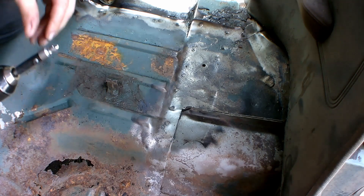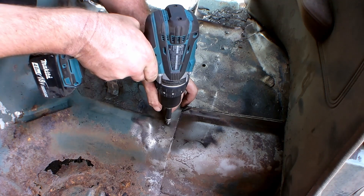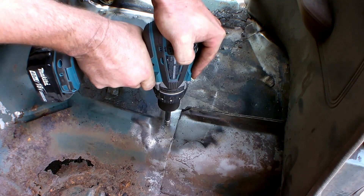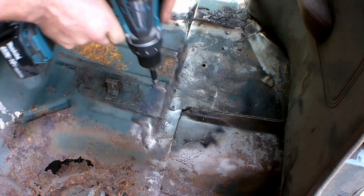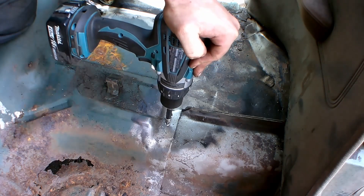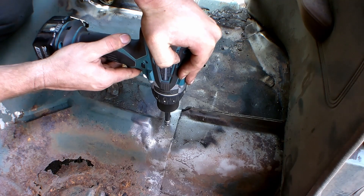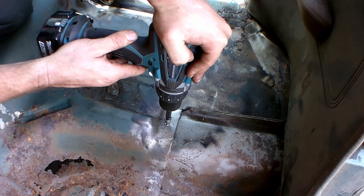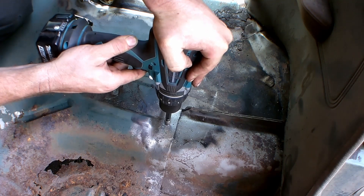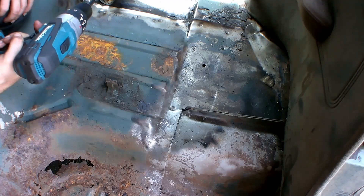You make a nice little starting pilot hole. Once you've done that, you have the little pilot drill bit that sits in the very tip of the cutter, and then you have your cutting edge around there. Get your drill bit centered on there, let it spin to make a nice little hole, then slowly push it down as it starts making contact, and it cuts it out.